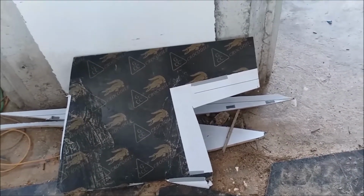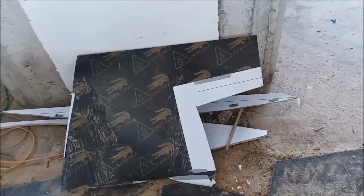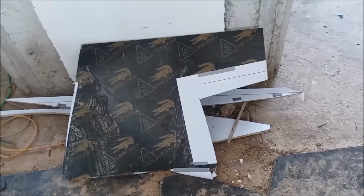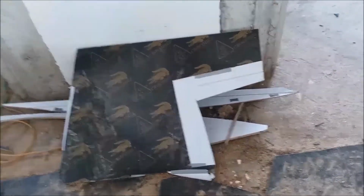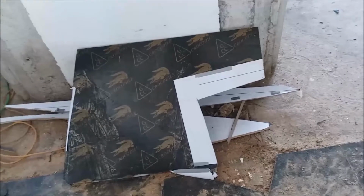Anyway, you put your wallpaper paste on the side that you've unrolled it off of, and then you roll the pipe back, and it puts the sheet back exactly where it was when you rolled it up, because the other end was taped and never taken loose. And when you unroll it, the pipe just unrolls straight back to where you started rolling it. As long as you keep the tension on it when you unroll it, it goes.